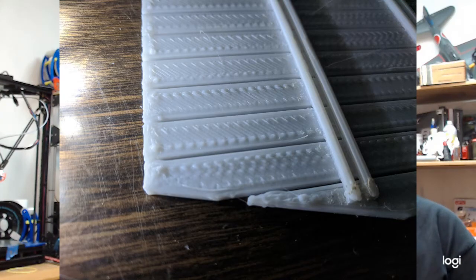And what was effectively happening is because I was running with a 0.4 millimeter nozzle, but I was programmed for a 0.8 millimeter nozzle, the printer was putting way too much plastic through that 0.4 millimeter nozzle, but my stepovers were too wide for even that to completely fill in. But every time I'd go to do a retraction, there was so much back pressure that I couldn't get enough retraction to stop it from having the issues that it was having.